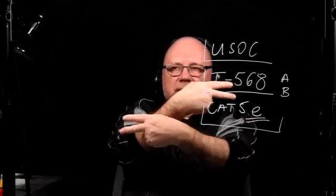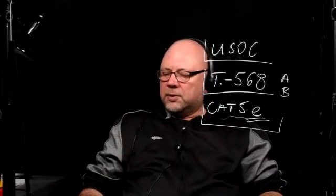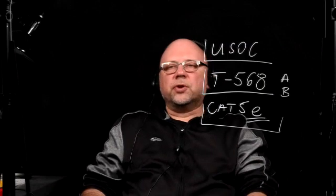One is transmit and one is receive. So on one pair, the communication goes one way, and the other pair, the communication goes the other way. Which one is transmit and which one is receive? Well, that depends on which end of the cable you're looking at. You look at this end, the communication is going this way. You look the other way, the communication goes the other way. So one is transmit, one is receive. I said that last time when we were talking, actually yesterday. Sometimes it helps you to know that.